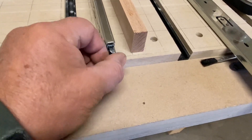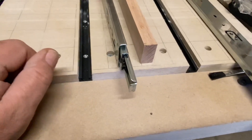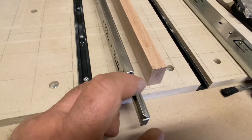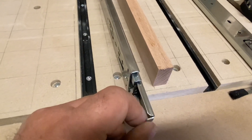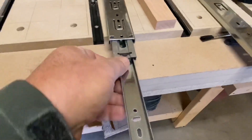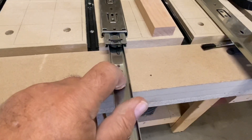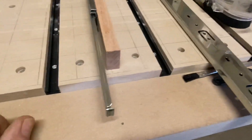However, I wound up doing it a little bit differently. I put the smaller inner slide and attached it to the stationary 1x material, and then the outer casing is mounted to the side panel of the enclosure. One major reason I did that is if you were to mount the side panel to the smaller inner slide, you would never be able to get it off your rails because you need access to the mechanism to actually remove it, and it's right there. If I had mounted it to the side panel, it would be resting up against the 1x material and you wouldn't be able to take that off.